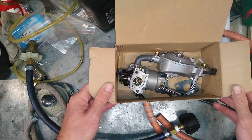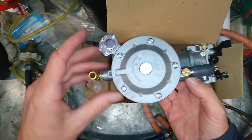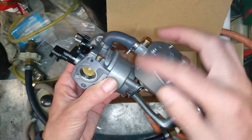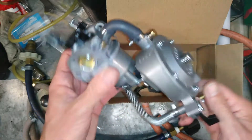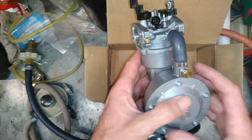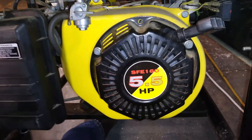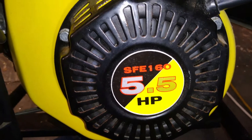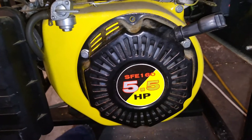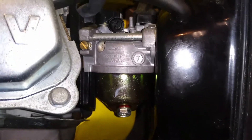Today I received in our mail system one of these. This is the dual fuel carburetor I'm talking about, which can fit on the little Spitfire generator. This is the carburetor here — petrol — and this area here is for the LPG. These are standard carburetors for a Honda 160 engine, and what we have on that generator is a Chinese copy of a Honda engine. It's a 5.5 horsepower SFE 160, which is the same as a Honda 160. The carburetor on the Honda 160 engine is exactly the same because it's all a copy.